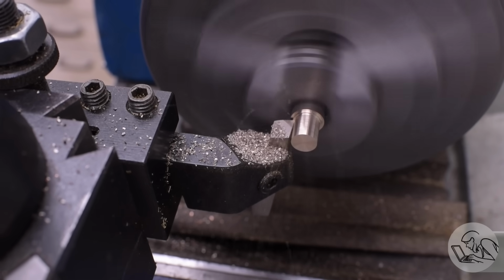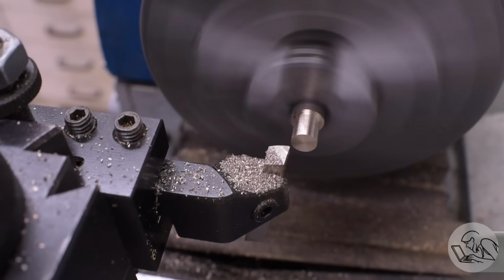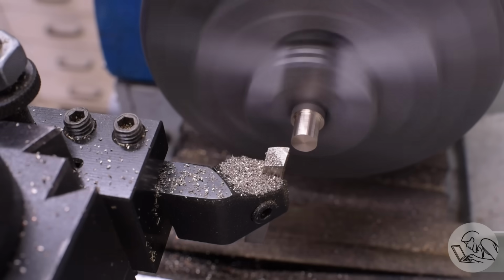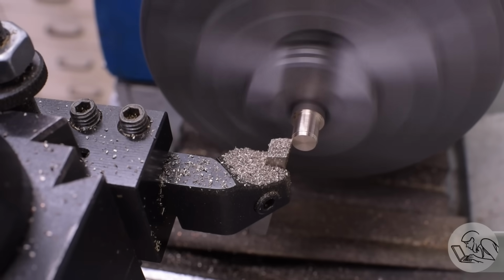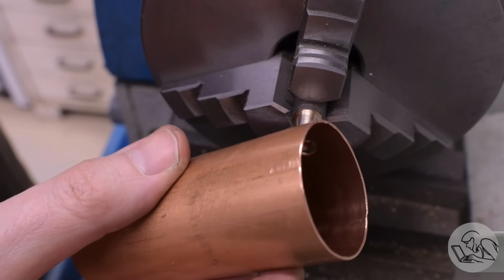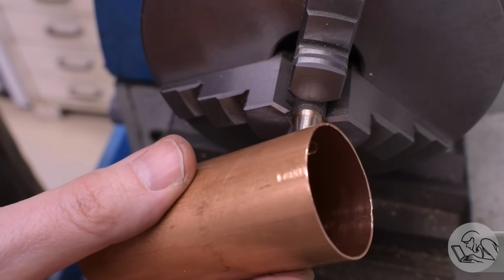The factory boiler did have boiler bushings, but they were on the inside. They were like threaded washers, essentially, that had been threaded into the backs of the fittings and then soldered in place after the fact. Again, it's probably well suited to manufacture, but I'm going to do it the traditional model engineer way.